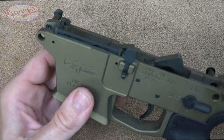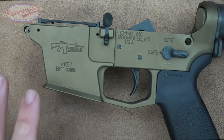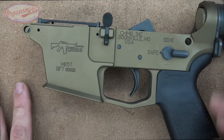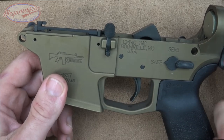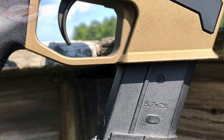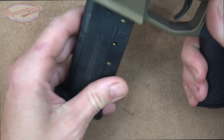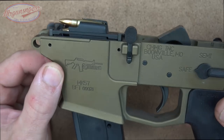On the lower, there are some different things going on — it's not similar to an AR-15 lower. It's billet 7075 T6 aluminum rather than forged, and the black version would have Type 3 hard anodizing. It's purpose-built for the 5.7 round. Just like the Guard pistols, they modified the mag well so everything sits correctly and you have a good feeding angle from the magazine. It ships with a Pro Mag 20-round magazine.